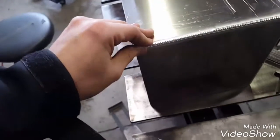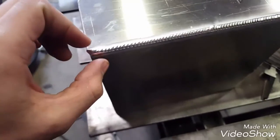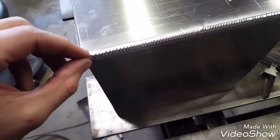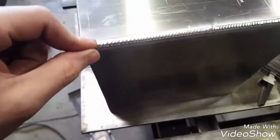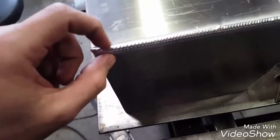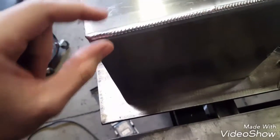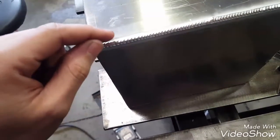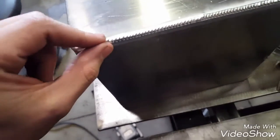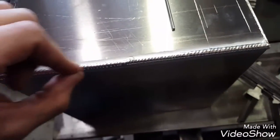On outside corners, the way I do it is really simple — I like to burn it in until it just starts to nip both corners evenly, and that's when I start moving and adding rod. Some people do it differently, but I like it to where it gets both corners and when you move, the puddle actually moves. If you start moving and it just craters around it, it's not hot enough — give it just a little more until it's even all the way across and moves with you. That's how you get a nice consistent bead width and profile.